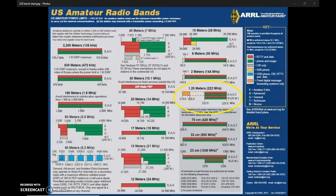Starting in 1981, there was the AMTS — the Automated Maritime Telecommunications Service — which used this portion for basically voice and data, relaying digital traffic from one source to another with a digipeater in between. If you're familiar with APRS or 2-meter packet, you'll know what a digipeater is. This is on a limited secondary basis, not available in certain regions like Region 1 or Region 3. Your amateur traffic is from 222 to 225. Some China radios that boast 220 capability actually span well across 219 to 225, so you need to be careful where you're transmitting. If you're looking for contacts, it'll be up in the amateur portion.